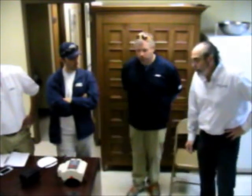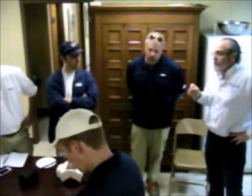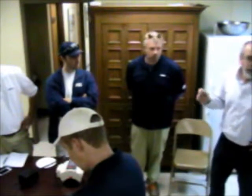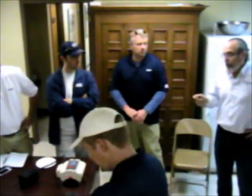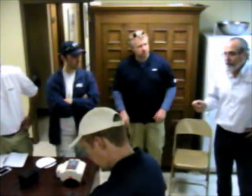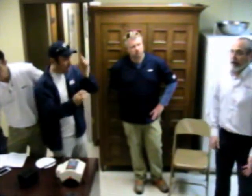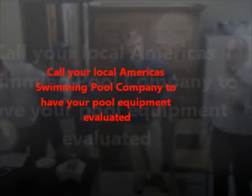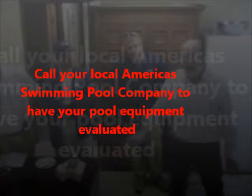This next one is very important to me — it says 'set temperature,' pump temperature. It's an internal freeze sensor. It comes set from the factory at 40 degrees. If you leave it at 40 degrees, depending on where it's sitting on the house, I will promise you it's not going to freeze anything up — but it's probably going to turn on around 29 or 30 degrees. It's about a 10-degree temperature difference from what the internal temperature on this is versus the actual outside air temperature. People start to freak out: 'My pump's not running, it's 31 degrees.' But it's 31 degrees at the airport — what's the temperature right over there on the side of the house next to your pump? It could still be 38.